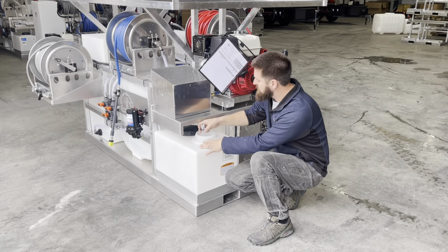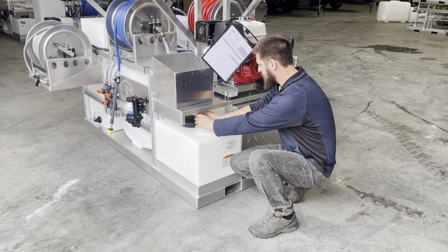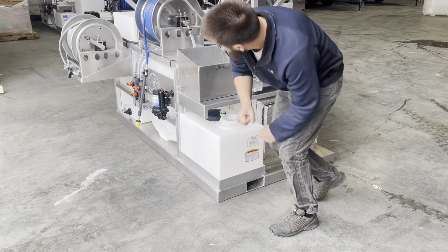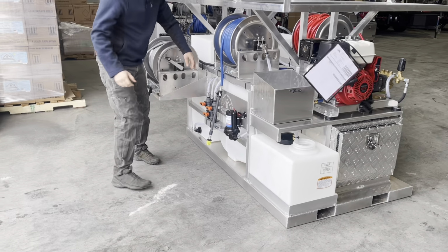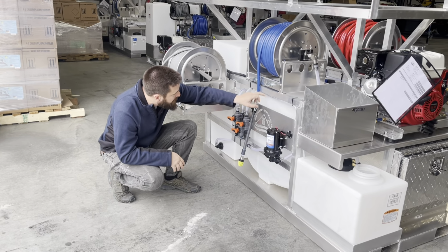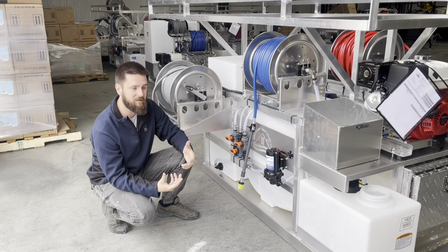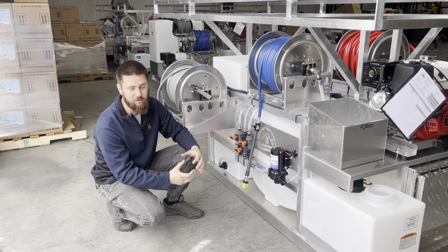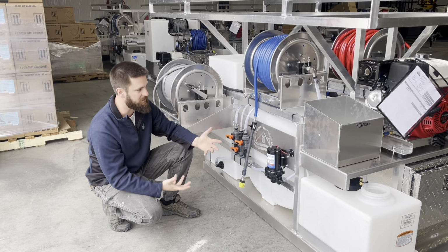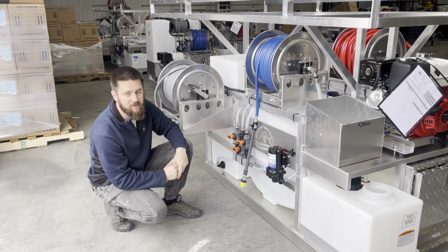The easiest way for me to simulate an air leak is just to pull the suction lines out of the tank. We'll stick them up in the air on the surfactant tank. That's the easiest one to get to. It could be up here on the bulkhead for the water tank. It could be up here on the bulkhead. You can't see it for the bleach tank. Some of these hose clamps may have shifted. We've actually seen cracked bulkheads, and these are really thick-walled banjo bulkheads, but still, they're a couple years old, sitting in the sunlight, they get brittle, they may crack. It could be any of these connection points on the blend manifold.